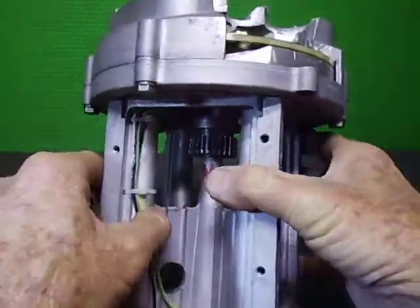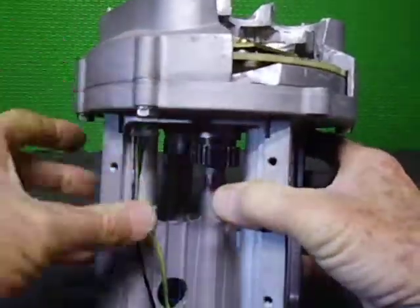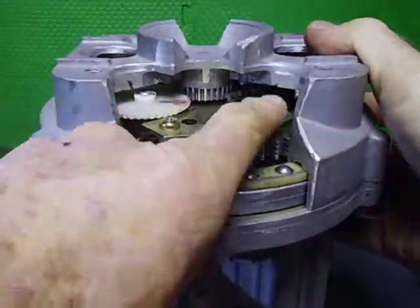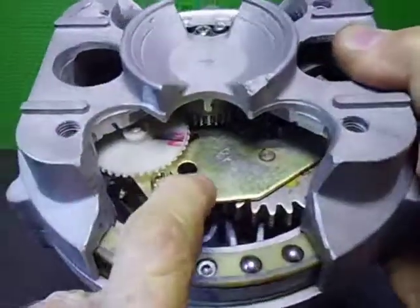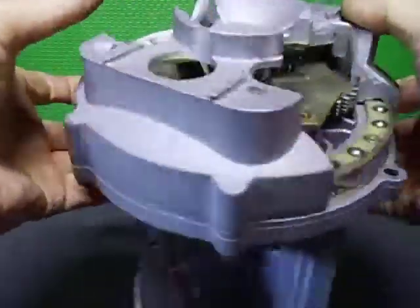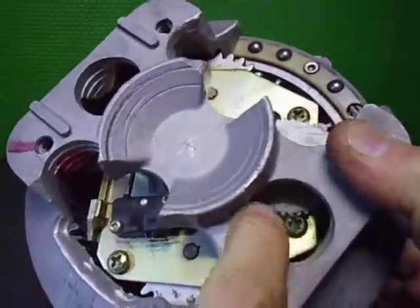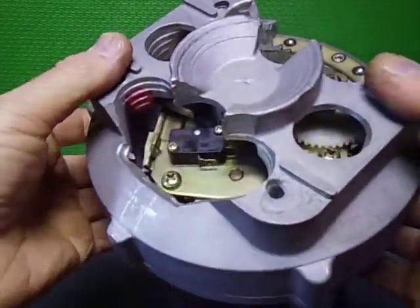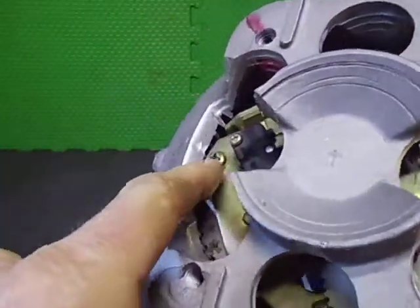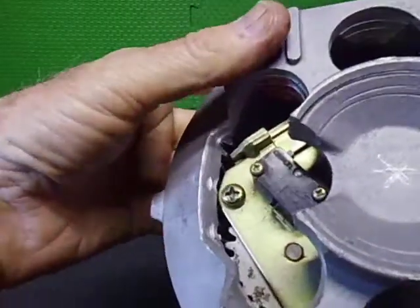These normally have more wires in them, but I've just got the potentiometer wires there for testing. Up in here you've got the limit switches, so the wiring would come in and go down through these holes. Again, really close tolerances — if you don't maintain the positioning, you could have a big problem with wires getting caught up. You can see how close the hole is to where the wires go down, and how close the sub-chassis gets to the actual casing. Everything is just really, really close.